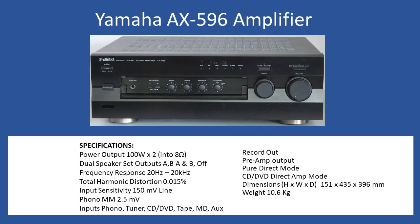The amplifier provides 100 watts RMS into 8 ohms per channel. You can select speaker set A, B, or both, or use the headphone jack. There's a drop-down flap on the front giving access to tone controls — balance, treble, and bass — plus a loudness control on the right before the channel selector. That goes from flat response all the way to minus 30 dB, and frequency response is 20 Hz to 20 kHz.